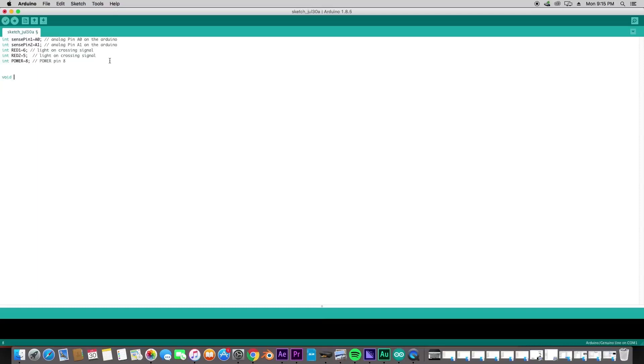That's pretty much everything for the setup. We'll go ahead and do void setup(), start a bracket, and type Serial.begin(9600). If you don't remember what this is for, I'm going to put a link up here for my previous video that shows you what Serial.begin sets up — it's basically where you can read what the sensor is giving you so that you can tweak the program to match exactly what your sensors give off. This enables display of sensor output.